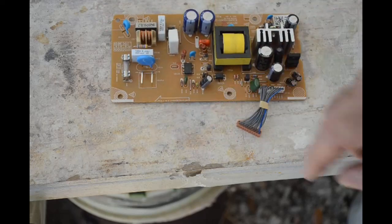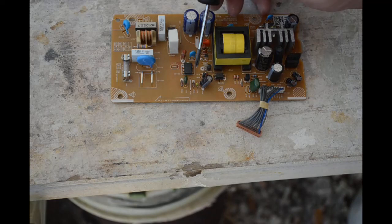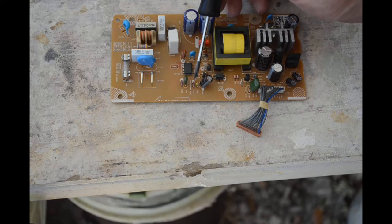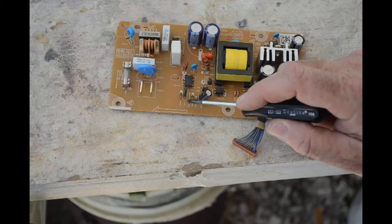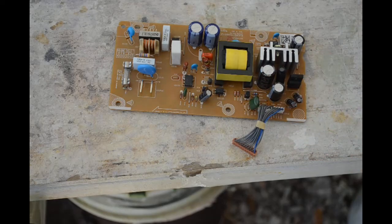Or over here, if you look at these tiny little glass signal diodes here, they must be Zener diodes because that's ZD8 something. That print is so small I can't read it, but I see the ZD part. So ZD. So, you know, there's lots of different ways that they're going to designate them as diodes. CR almost always means a diode. If the number starts with a D, it's almost certainly a diode. ZD, it's going to be a diode, a Zener diode.